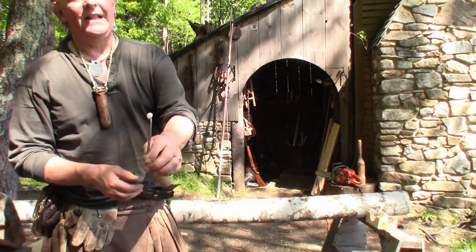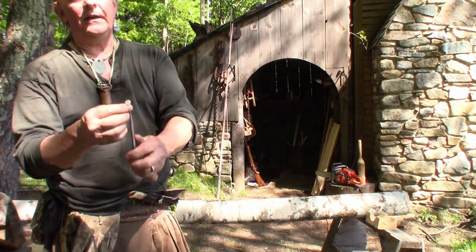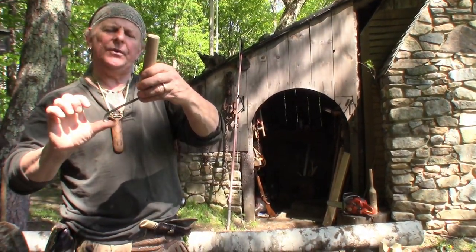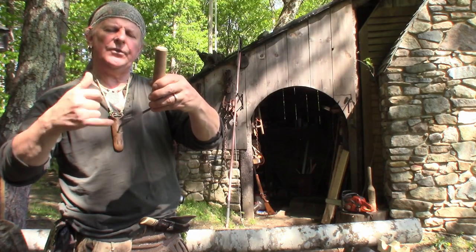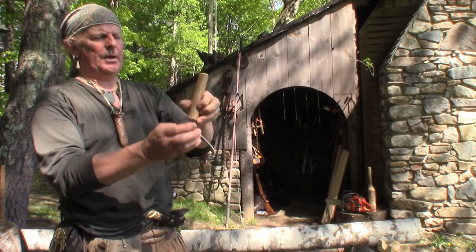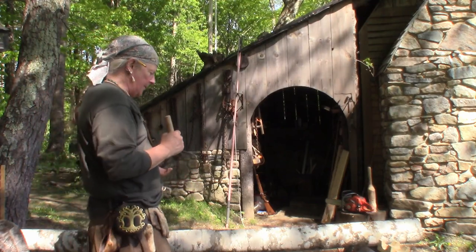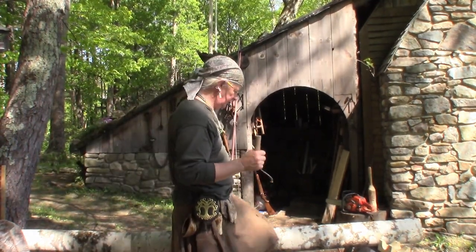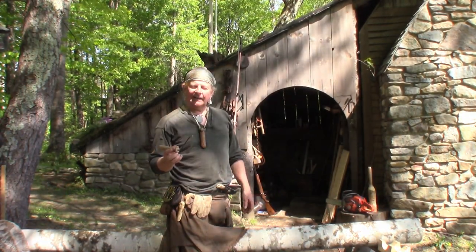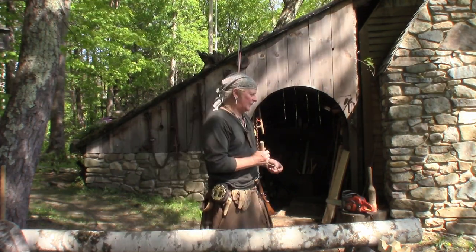So I made this thing — it looks like I made it out of a nail, but I didn't. I upset the end of this piece of tool steel, like the head of a nail. I made this little thing you'd call a shoe, and that is meant to slip underneath the bark. Up above it here is a sharp blade, so I start at one end, set that under the bark, and pull it right down. It might bruise that inner skin but it won't cut it. This is a tool completely of your own invention? Yeah — necessity is the mother. Let's see if it works.